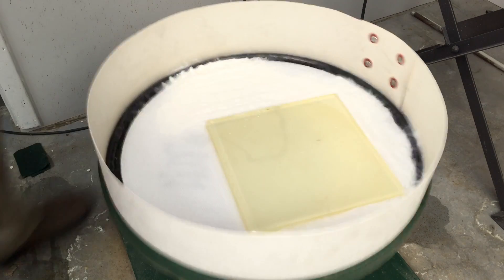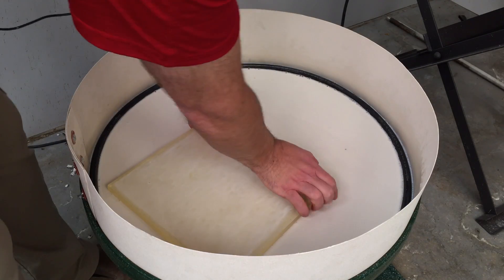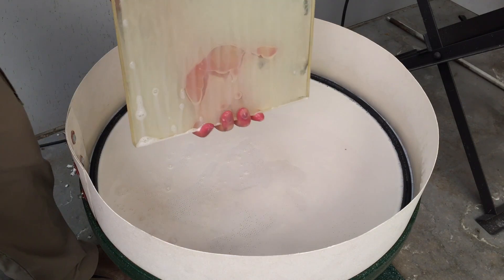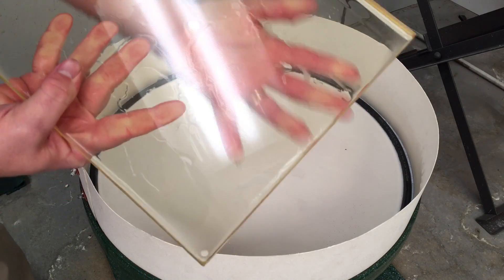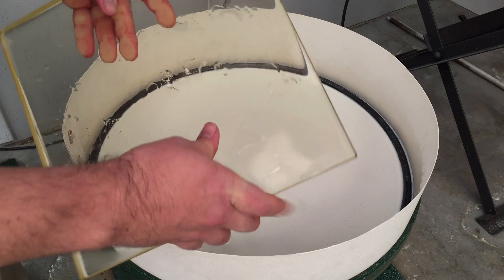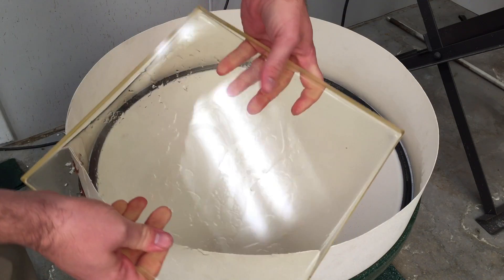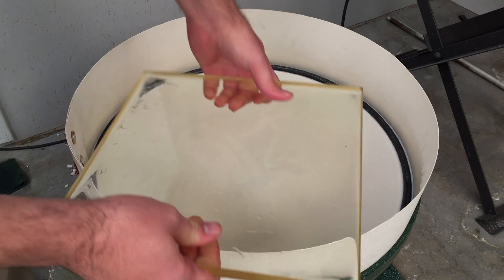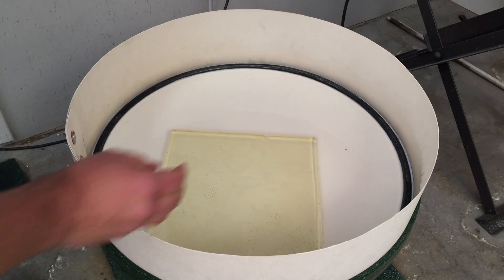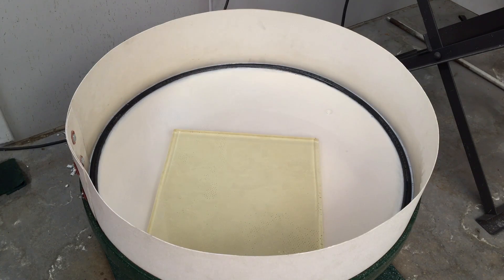Turn it on. Our Reciprolap has been running for about five hours — just shut it off. It's suctioned in quite nicely. After about five hours this is a pretty good polish. I've still got some corner issues — it hasn't quite reached some of the corners yet — but the majority of the piece has a very nice polish, as you can see. I'm going to leave it go a little bit longer to see if it can get down to the corners, and I am going to add just a little bit more water. You have to be very careful at the polishing stage to make sure it does not dry out, as your felt pad will absorb quite a bit of moisture.